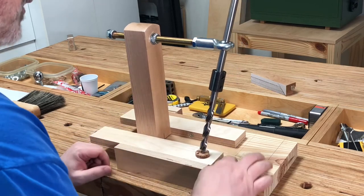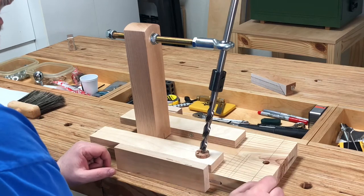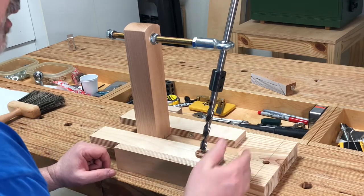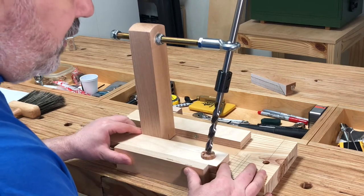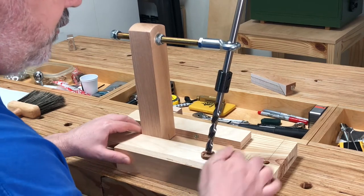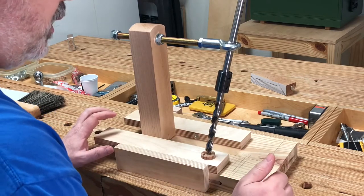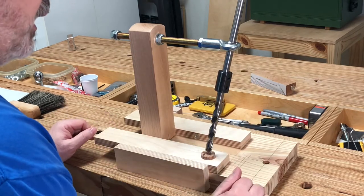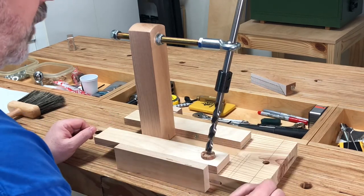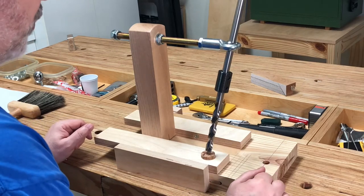You can see I've got a lot of vertical marks here and little holes. This is just where I calibrate it — I move the end of the runner up, place the drill bit in this little hole, and it will be square. There are a bunch of holes because they wallow out over time and I have to put new ones in, but you probably won't have to do that.